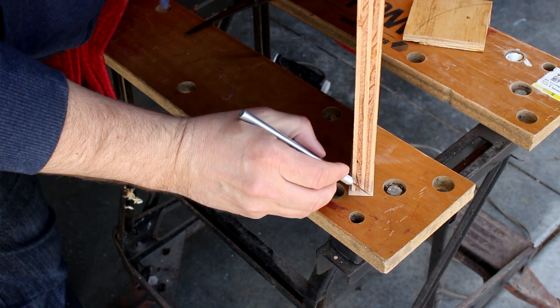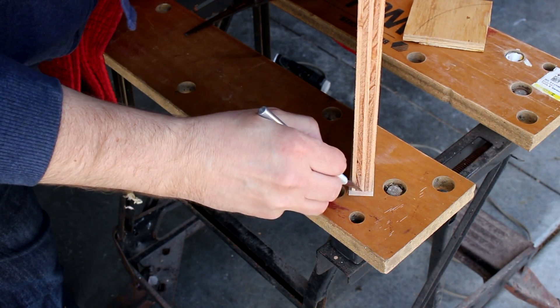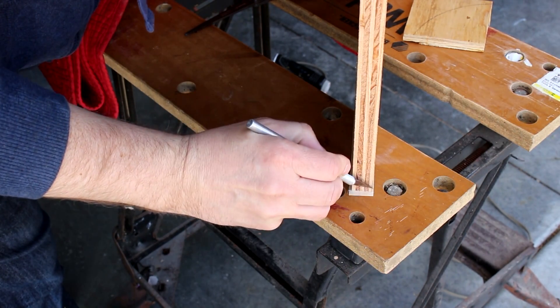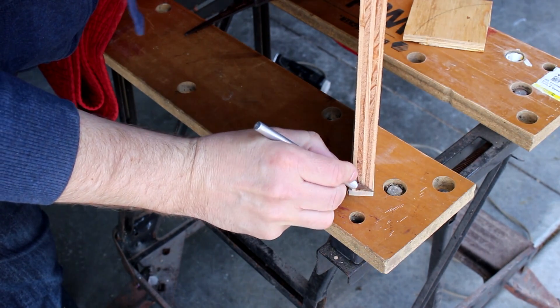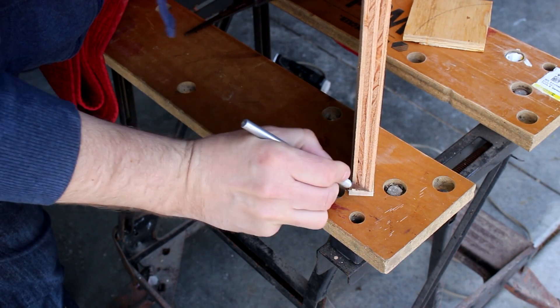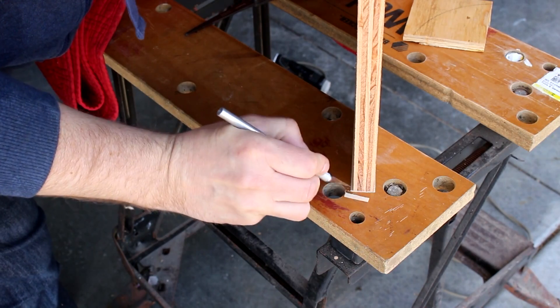Here I'm just trimming off the excess overhang on the edge with an X-Acto knife. In my experience, the trick to cutting veneer is to first get a sharp knife, and then don't try to cut through the entire thickness at once. Make many light passes until you work your way through it, and then it'll just fall off.